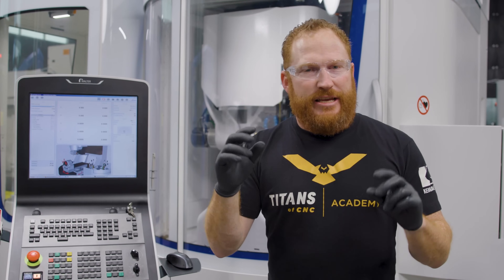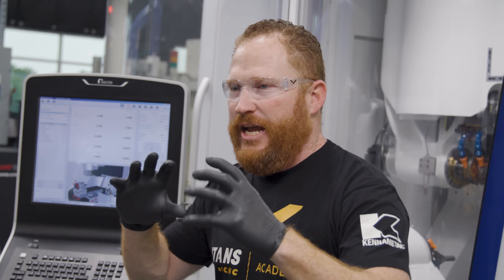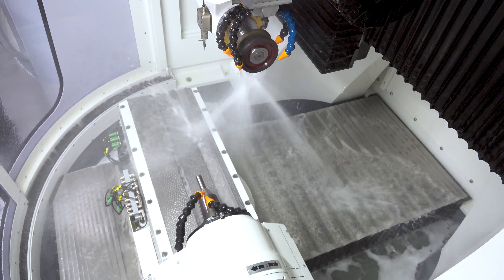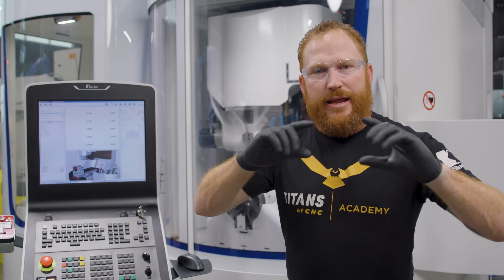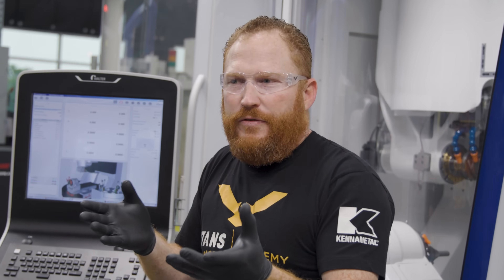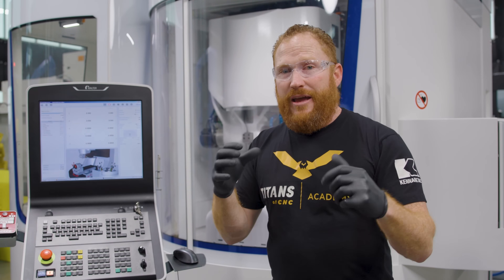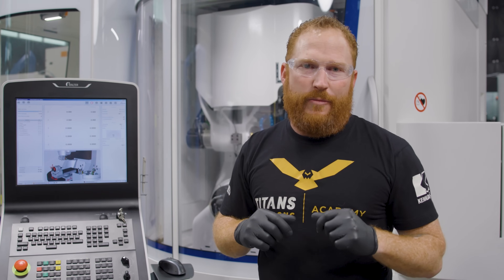This machine's A-axis is a torque drive, which actually gives us the ability to machine while the part is spinning. This feature is critical if we want to preform carbide. In a typical tool machine, you cannot spin the A-axis fast enough to form the tool similarly to turning on a lathe. But this machine has that capability and the A-axis can spin with power at 750 RPM.